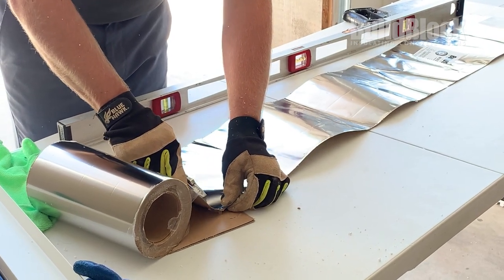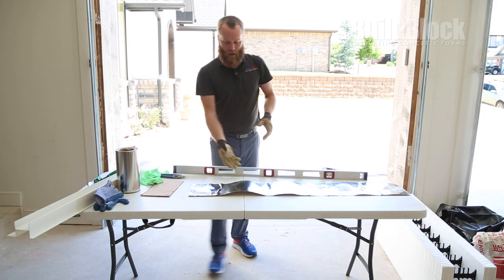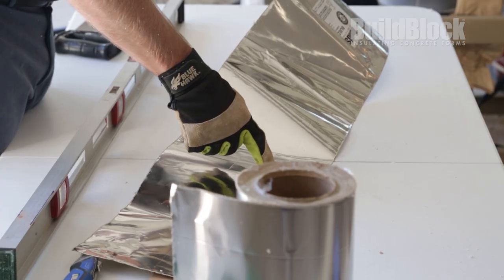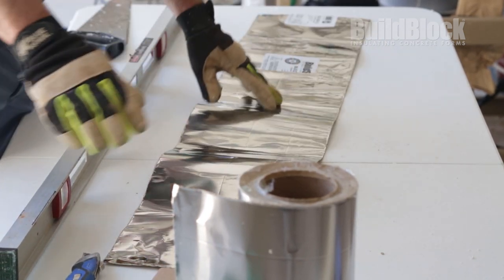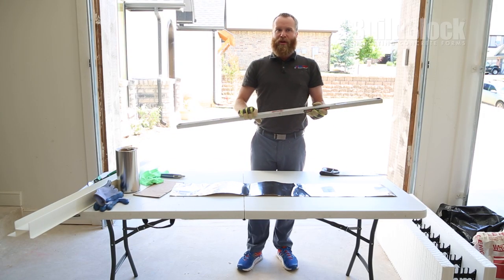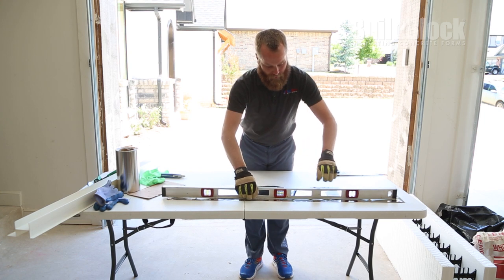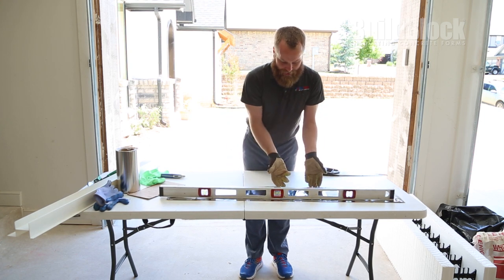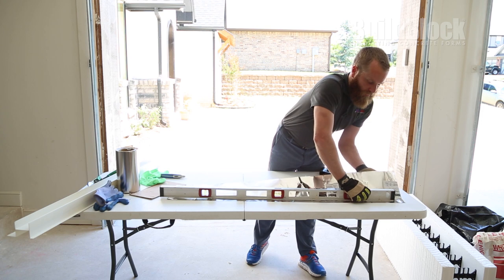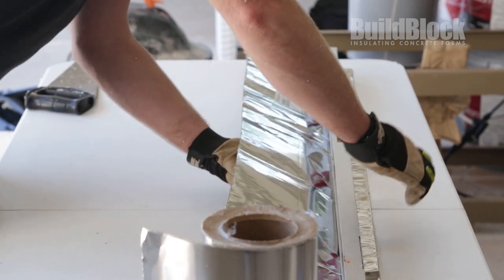A light score is enough to be able to cut through the shield. Occasionally the paper backing will stick in a few spots. I do want to note — as you're looking at the actual shield you'll notice these score lines. These score lines are going to fit directly underneath the extrusion itself. So this is where you will fold the shield itself. Using a straight edge is one of the best ways to be able to crease the actual shield, and that allows me to crease right along there.